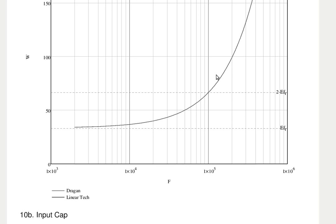What are the limits to this? Is there going to be a perfect magnetic material with zero hysteresis? There will always be trade-offs. That's why I calculated it for the whole raft of materials, because it's very frequency dependent. There might be dedicated ones for particular frequencies? Yeah. Is that what you're using? Are these ones for that specific frequency, or are they more generalized? 3C94 material is good for 100 kilohertz.